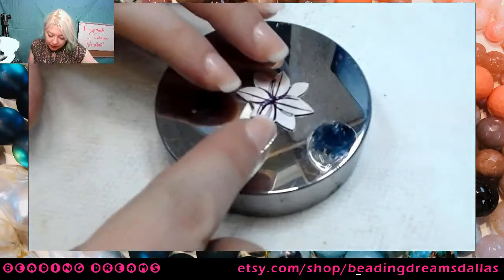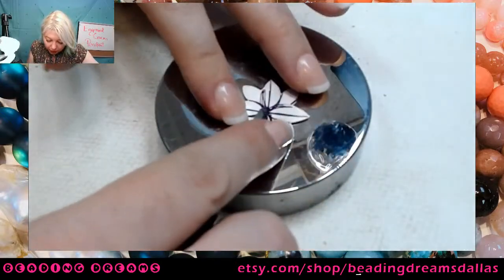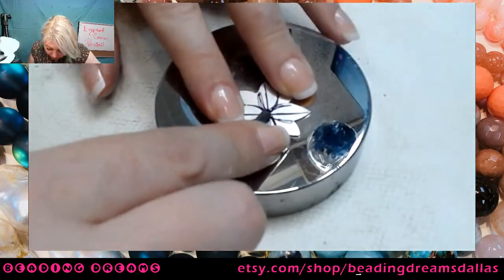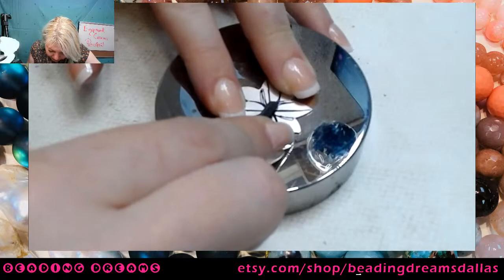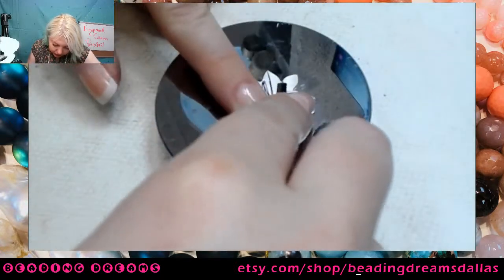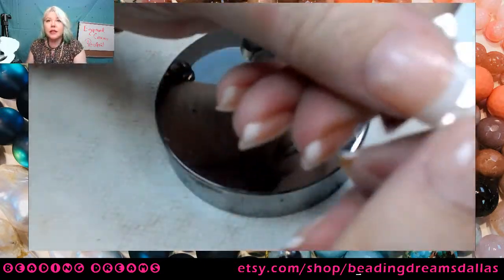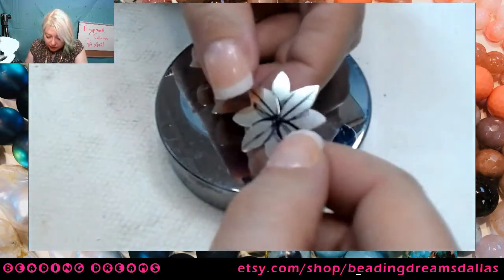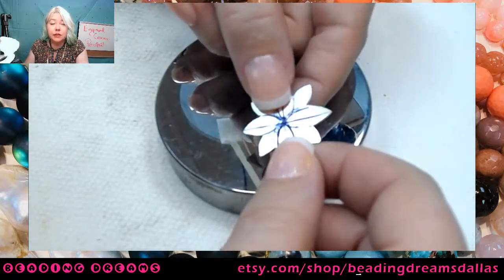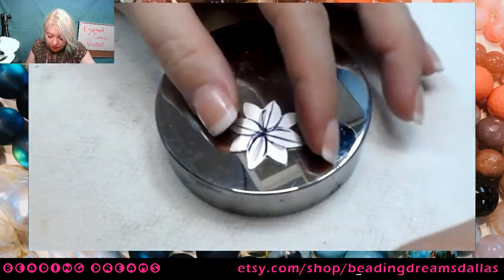So, when you're using your graver, you want to put the handle in the palm of your hand. And this is like sawing. You don't want to press too hard. You're just going to set your graver on your metal, and you're going to press a little bit and follow the line. Meep. And so what that's going to do is, you may or may not be able to see, but there, see that? See that little glint there? That's a line that I have engraved into the surface of my metal.